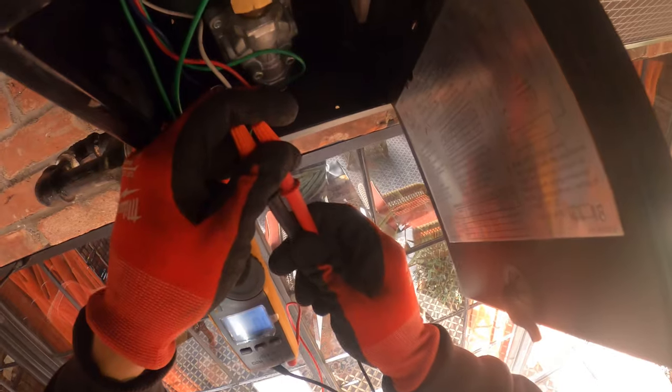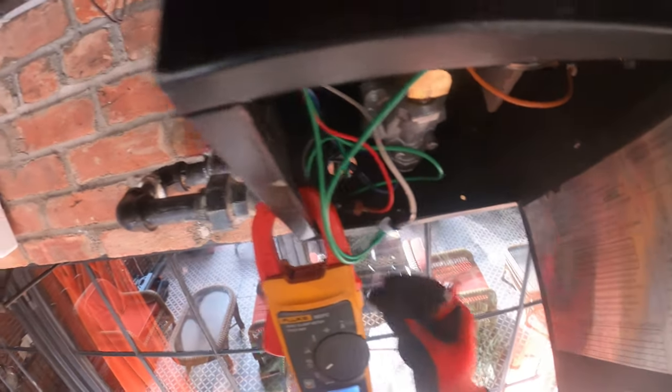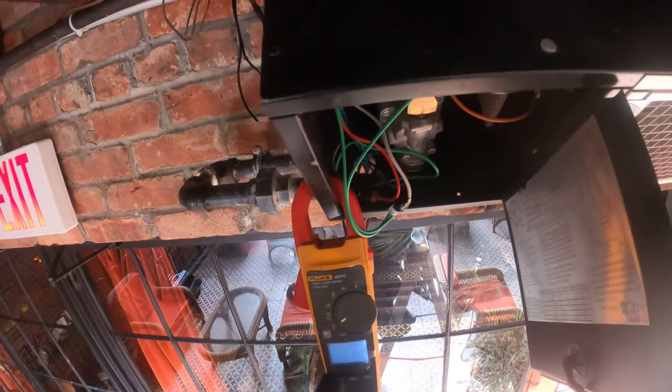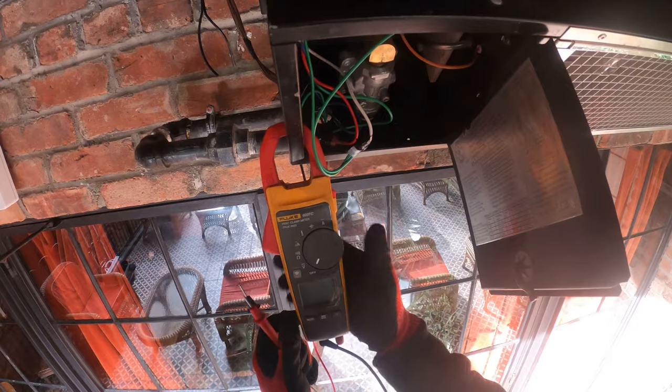And that's why we have nothing — no power at all. There's no voltage here, we don't have 24 volts, we lost it. So I need to find the transformer. The engineer said there's one transformer for both these units and it's somewhere in the ceiling, so let's go find that.